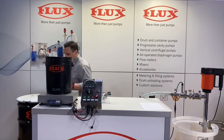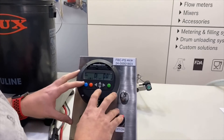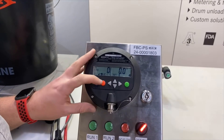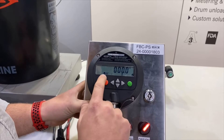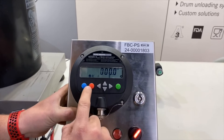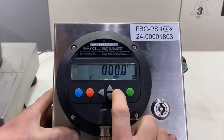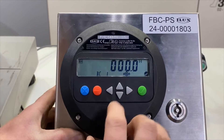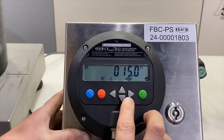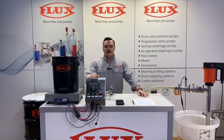Now we're going to go through the calibration of the actual control box and meter. First we're going to go to the BC1 setting — that's Batch Control 1. We're going to hit this red button that selects which one we want to use; there are ten different options. Use the arrows to select through those. We're going to set one, so we hit the red button one more time and now we are adjusting what we want our batch size to be. We're going to use 15. Navigate through the menu using the up and down arrows, and once you have it set, hit the green button to confirm.